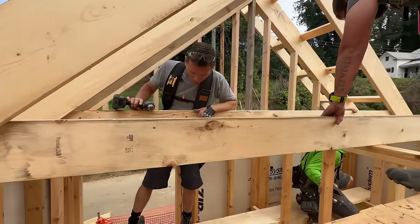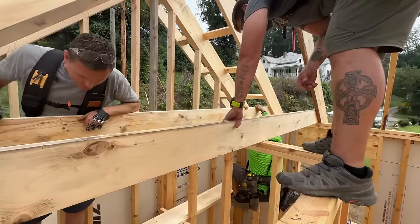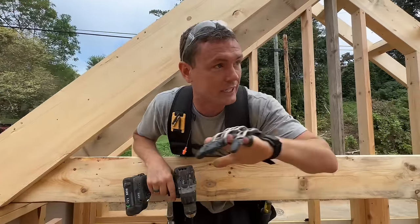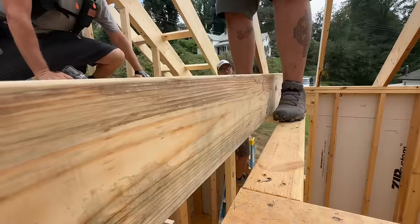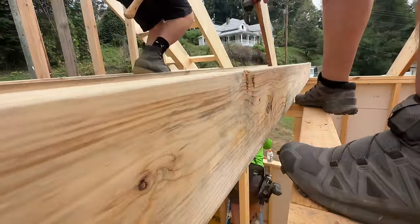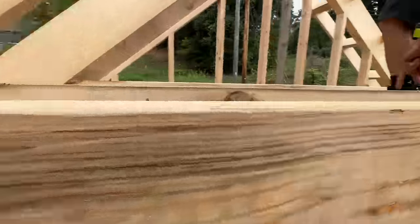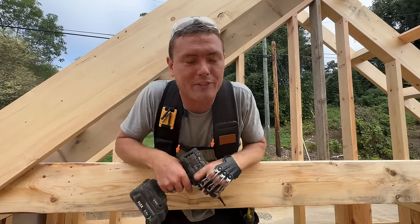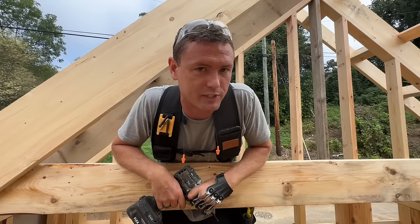We're installing our ceiling joists on the non-vaulted part of the back of the house here. It's easier to finish a non-vaulted ceiling. It takes less time and money. It sure does. For this part, even though it would be amazing to have vaulted ceilings in the laundry room, with vaulted big closets, beam collar ties running through the laundry and the small little bath here, we're actually going flat for efficiency's sake.